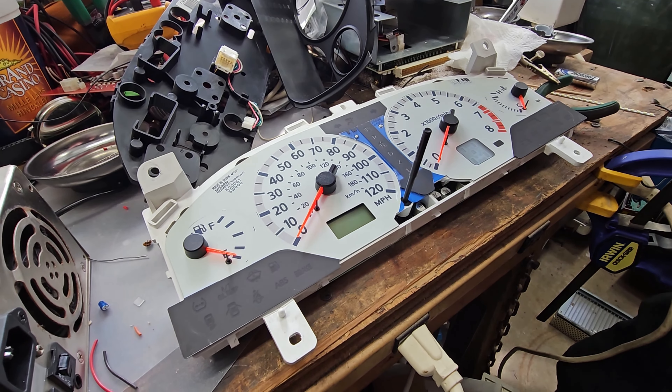After re-soldering these four resistors, now when we check the resistors, instead of reading almost 500 ohms on just this one, the total circuit reads 121 ohms. So I think we have definitely found and fixed the problem. This was resistor R99.